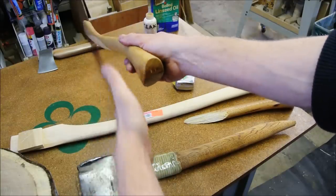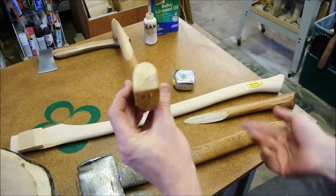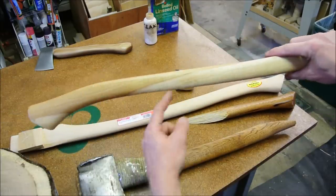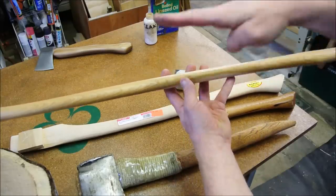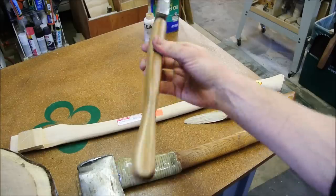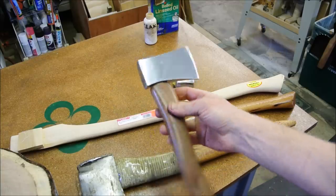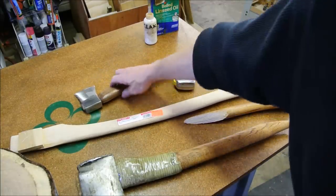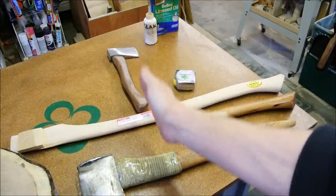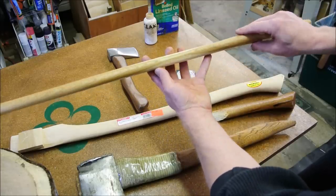A real quick explanation: you want the grain orientation to be running up and down on the axe handle. It should not be off to the side or curvy. This one is at about a 45-degree angle, which makes it half wrong. Another giveaway is look how from top to bottom there's a color change — that's incorrect. You should see a color change from this direction. Here's a better example I did myself. Look how dark it is on one side and light on the other. That's because there's a difference in heartwood, which is darker on the inside. So that gives you an indication that the grain lines are going in the correct direction. Fading from top to bottom: bad. Fading from side to side: good.